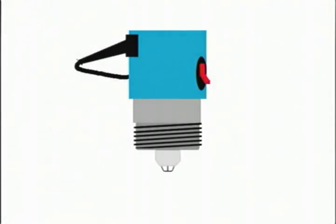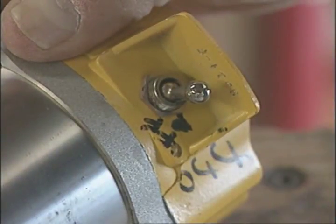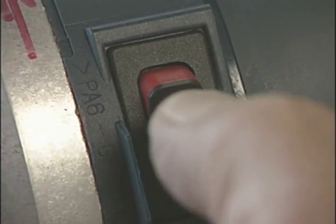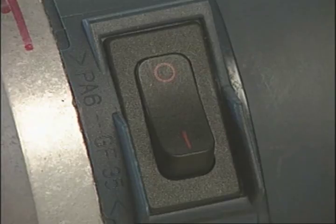Let's take a quick look at how the switches can vary. The yellow DeWalt has a toggle switch that's always in the same place with respect to the grip handles on its base casting. It's protected somewhat from an accidental start by a hood, which is part of the casting. The Bosch tool has a reasonably well protected rocker switch with international on and off symbols. It functions well, but I'm not always sure of its position when I'm plugging it in a few feet away.